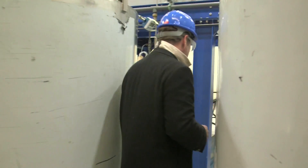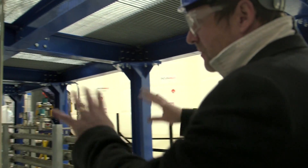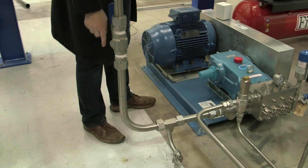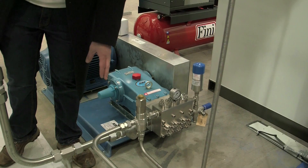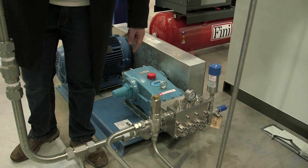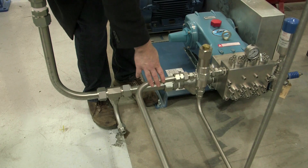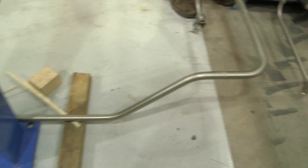Those will go in here, and then we've got to come through this very small gap. All of this will be encased in bulletproof screening, because this is the pressurised side. The precursor flows straight down here into the pump - this is where it becomes pressurised. On this side of the pump heads, we've got pressurised fluid being taken all the way into the reactor - maybe 240 bar, depending on how we run it.